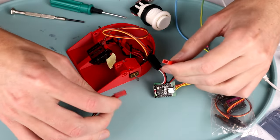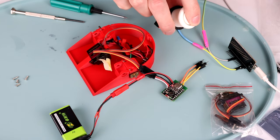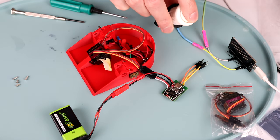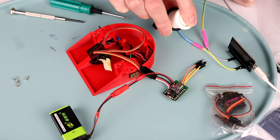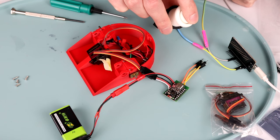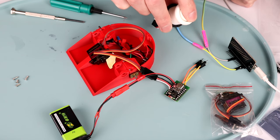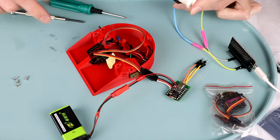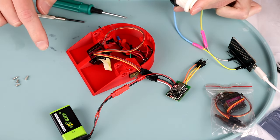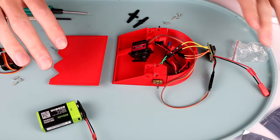The first thing we're going to do is power the receiver. We've gone the wrong way currently — we actually need to go the other direction, so that's zero and that's 90 currently, but I probably need to go from 90 to zero. Obviously the position of the servo arm will change when I put it on — I can have it laying down. So really all I worry about is when I press the button, which direction the flag is moving. And in this case it was going the wrong way. Okay, that is sorted now, so we can carry on with the rest of the build.